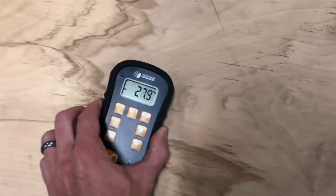They may not always have the time to test every slab all over, so I always keep this meter in my car. I go around and test different areas because it's very easy to find a pocket of trapped moisture, and that trapped moisture will likely compromise your slab in the end. If you don't want to purchase a moisture meter — totally understandable — make sure your slab supplier lets you test the slab you want to buy with their meter. Test all over the slab, because one area of trapped moisture can completely ruin your project once it starts to dry, twist, and warp.